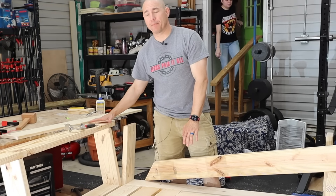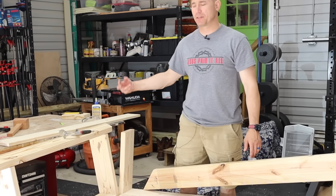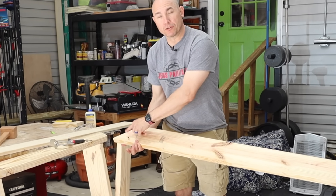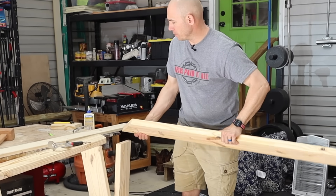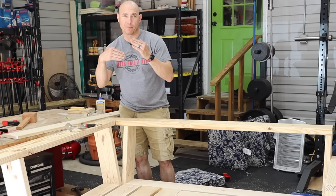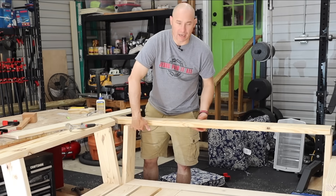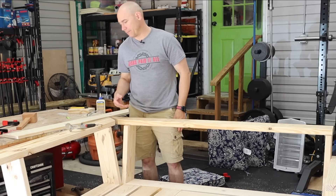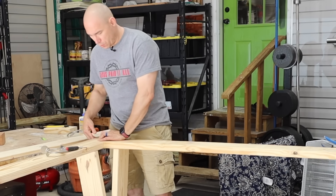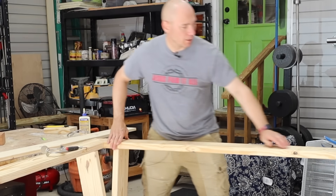Now it's time to put the top piece on to cap off these end grains. If you leave that end grain exposed, it's just going to soak up water. I went ahead and drilled two pocket holes in one of these 45 degree miters, and that's going to let you attach these two so they don't flex over time because they're just standing out there by themselves. Then we'll attach from underneath the pocket holes up into these top face boards. Make sure it's flush with the front side and that your corners are lining up before you attach everything.